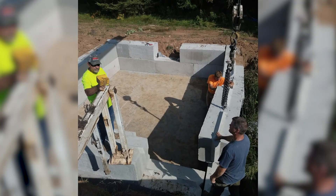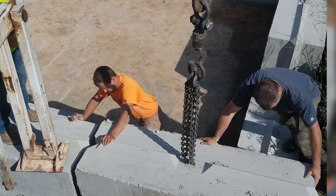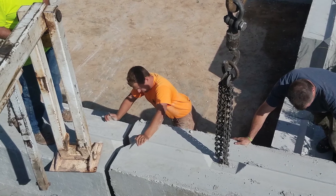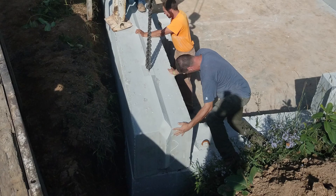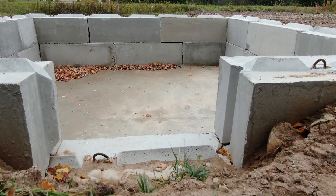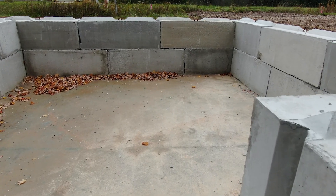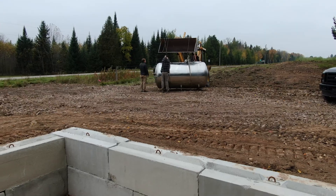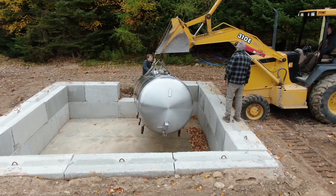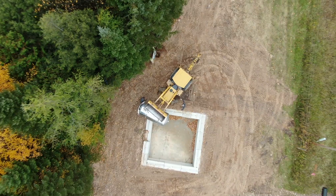This year we went in and put in these large retaining wall concrete blocks. The big ones are just shy of about 4,000 pounds — they interlock together and are about two feet tall each. We laid two courses of those blocks, giving us about a four-foot sidewall on the building. Before we ever built the top of it, we had to install the tanks, which we did with a backhoe and a couple of guys. The tanks are tipping downhill and everything is good to go.